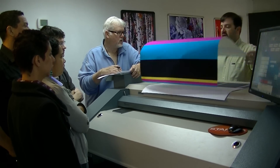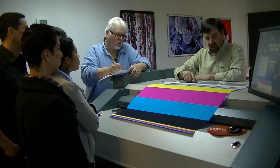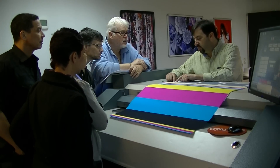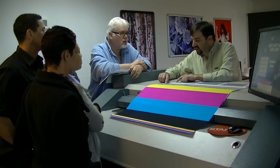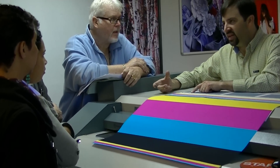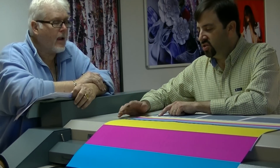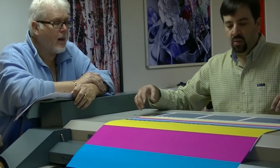Now we can take the CMYK bars that just printed out and overlay them on top of the calibration to see where the seams are lining up. You can see right here clearly where the seam is — we have a step in the Y direction but it looks pretty good in the X direction. You'd rather have an overlap than a gap, because mixed inside of a job you're not going to be able to see the overlap very much, but you will be able to see a gap. This looks pretty good in the X direction, it just needs some adjustment in the Y direction.